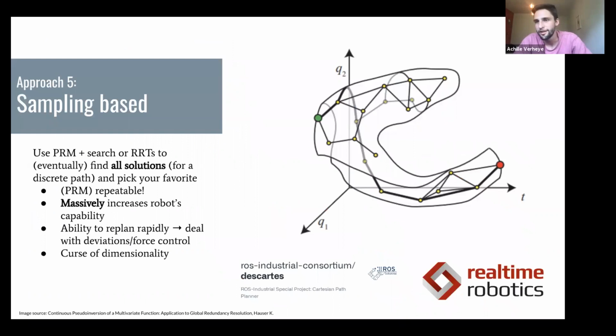And so that wasn't really motion planning. That was just solving IK and then saying, okay, we're going to do our greedy next step and maybe pick the closest solution. You'll still get stuck, because sometimes the entire motion planning problem itself is highly nonlinear, and just picking the greedy next best solution will definitely get you stuck. So what do you do? You construct a big grid over your space using all of those hopefully analytical inverse kinematic solutions that you found, and you A-star search or Dijkstra search your way through it. And that's actually pretty awesome. That works very well. There are a couple of companies and open source tools that do exactly that. And you can also use this PRM, this roadmap that you've created, to do really fast replanning, so you speed up your searches in the future.